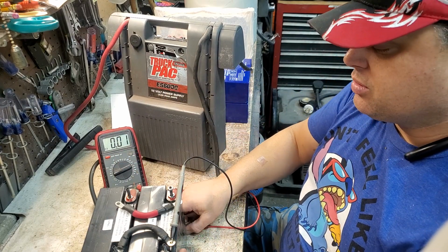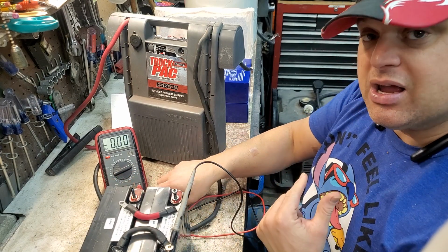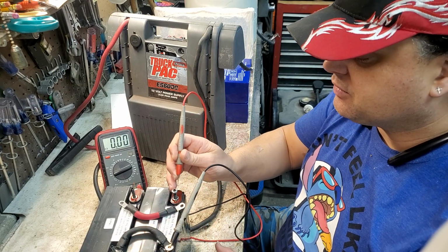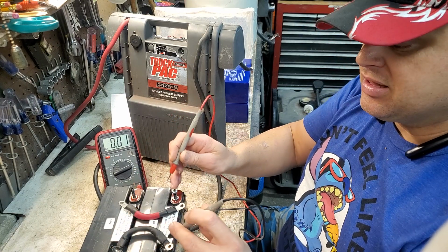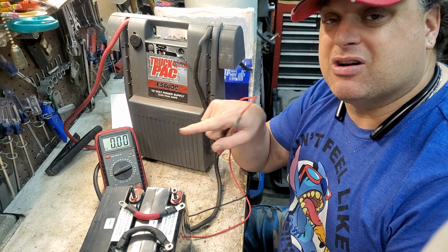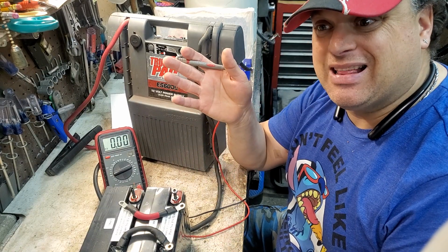When you get it out, okay, you're going to take the batteries out, and you're going to find that these batteries, for me, one of them was defective. This one over here is shorted out. If you look inside, and I show you the measurement, this one over here is charged. This one over here is not. But when I first got them out, they were both stuck at 4 volts. And I tried charging them, and it started stinking and smelling and causing problems.